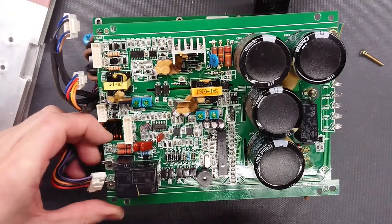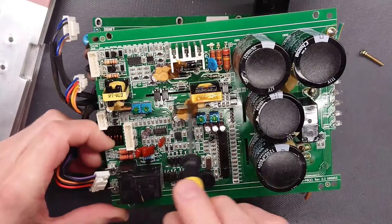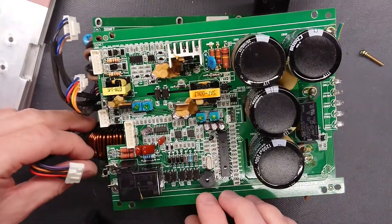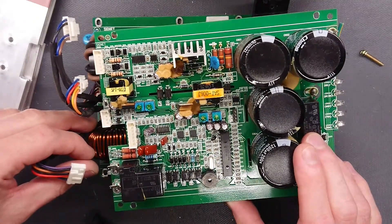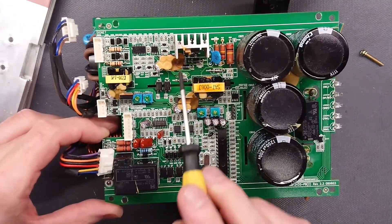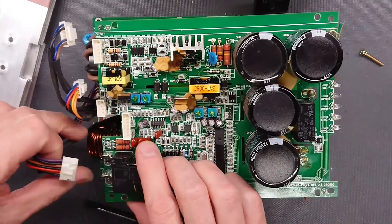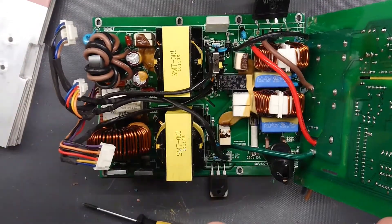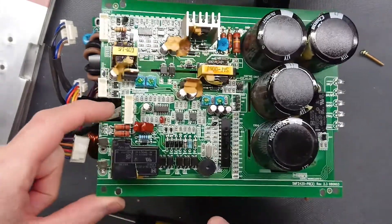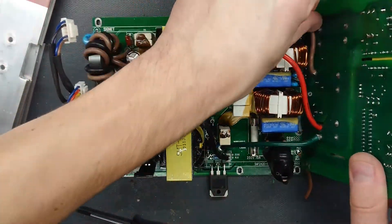It's a pretty clean layout. We have all the proper distances between the high voltage sides, so that's a pretty clean design — not much to criticize here. Good clearance between hot components, though maybe it's not ideal that warm components are placed right next to the electrolytic capacitors — that's bound to fail at some point. It does seem to have quite a high current relay up here, so maybe it's meant to disconnect its own 230 volt AC supply when it hits 100% battery charge.